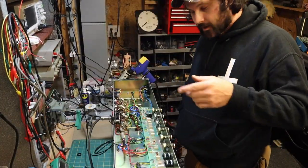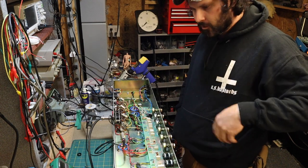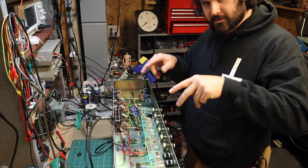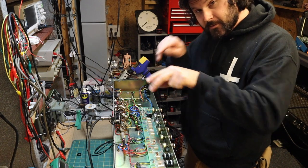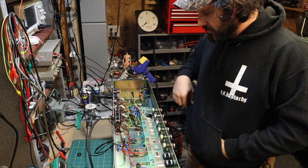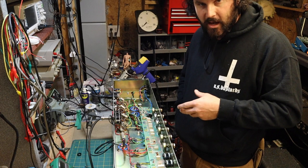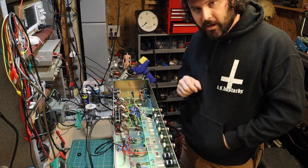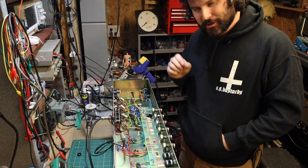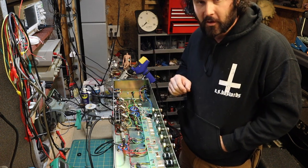Interesting. So I pulled the tube, put it back in just to check and make sure the orientation was right, no broken pins or something. And then, just to be certain on the actual meters, I flip-flopped my meters. Now I do have a good reading on the tube that I was getting zero on, which is telling me that there's a problem with the socket. We're going to hit it with DeoxIT, and I'll probably take a little screwdriver in there and re-tension them. It's really important to clean the sockets and tension them, because obviously there was a fault right there.